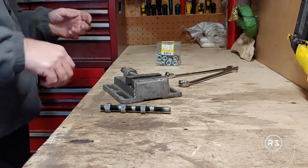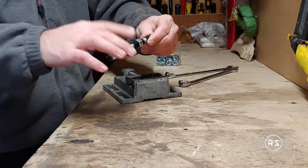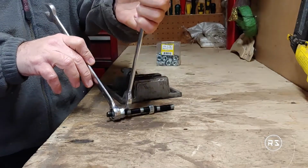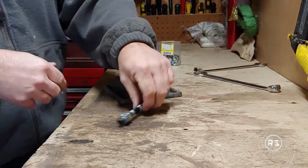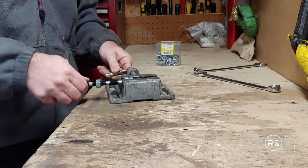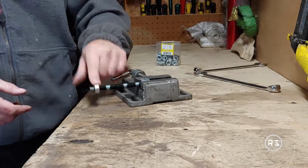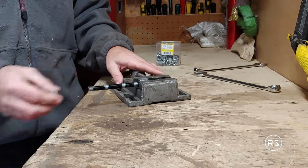Now when you do the end of a rod like that, your best bet is to unscrew or take a nut out on this end of the rod. So if the thread was still damaged after you shaved the end, when you unscrew the nuts on this side, it basically redoes or fixes the damaged thread. So as you can see, it's coming out pretty easily.